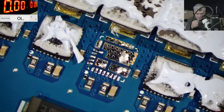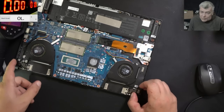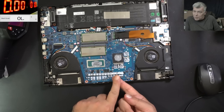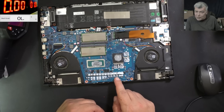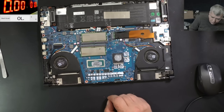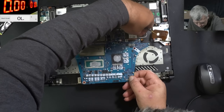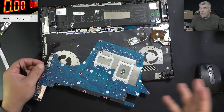Are you thinking what I'm thinking? These mosfets might be doubled on the other side of the board. So this mosfet was actually good but the dead one is on the other side — like a sandwich: top mosfet, bottom mosfet, to increase power to the GPU. That's the only way I can explain why that spot keeps getting hot. So I'm going to take the board out. Okay, the board is out — and no, there's no other row of mosfets on the back.